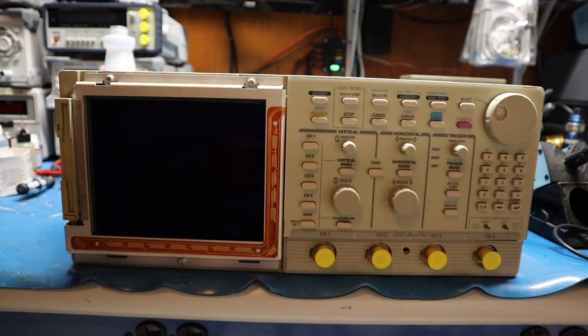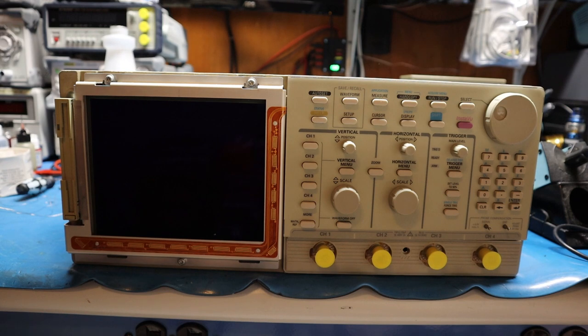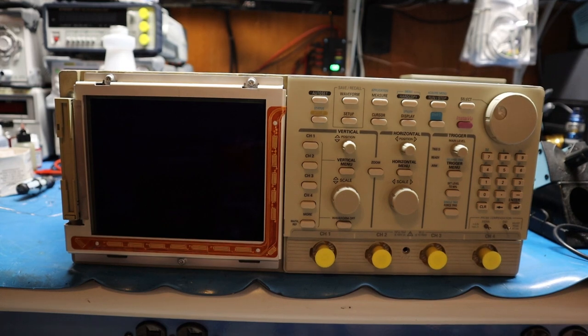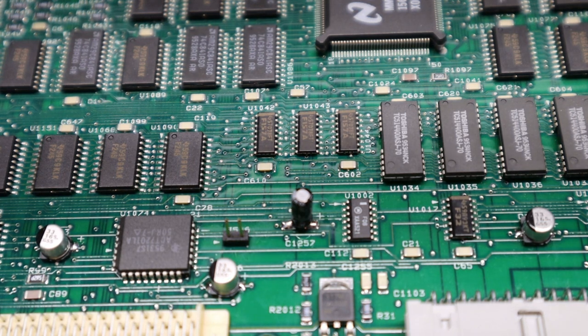I'm going to put the camera up and show you how to solder an SMD capacitor onto the board easily. When I move to the front panel I'll show you how to remove them using my method so you don't lift the pad — it's lower risk. Here's one of the through-hole capacitors I left on the board to demonstrate how to manually solder an SMD capacitor without needing a heat gun or taping off the board. First thing is to remove the old capacitor.